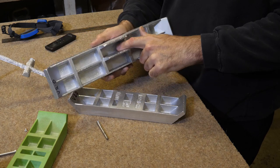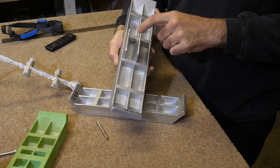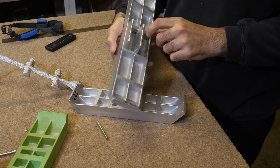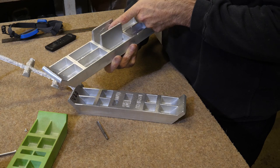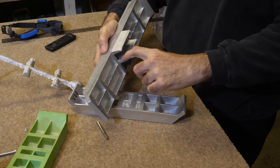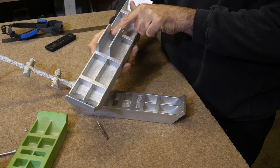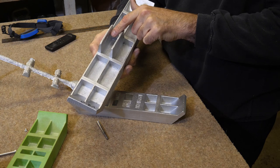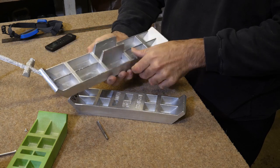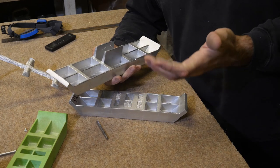So yeah, this was 5 degree draft. So that was really asking for trouble. It's no wonder that that wedge of sand got stuck in there. Absolutely no wonder. In fact, if you can see, it's a blooming miracle that I managed to stick that back in. And you can see the ridge where the aluminium seeped underneath the bit I stuck back down. I was very lucky. So yeah, these have now got 7 degrees. That should be a lot more forgiving. I mean, still not insanely forgiving.